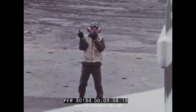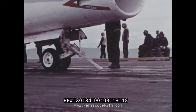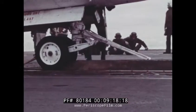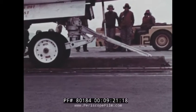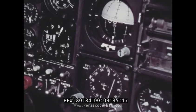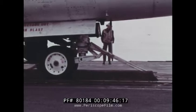When the plane is properly aligned, the director will signal the pilot to drop the launch bar. Then, as the holdback assembly stops the aircraft, the launch bar drops into the shuttle. Disengage the nose steering on the director's signal — do not use it after the launch bar is positioned in the track. When you're lined up with the cat, align the compass with the base recovery course. At light fuel weights, a one-finger turn-up may be required to depress the nose strut and allow the launch bar to drop into the shuttle.